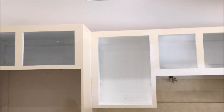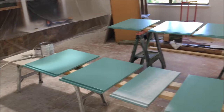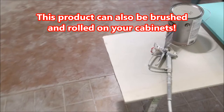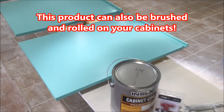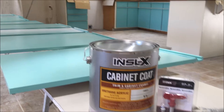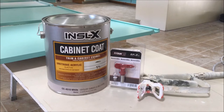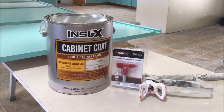I've got the insides primed, and there are all the doors from the uppers. I'm going to spray those with a cabinet paint that's a primer and paint all in one. I'm going to use a 313 spray tip. This sticks to Formica painted surfaces and comes out as a satin finish. I got it tinted at L4 from Richards Paint, which is a nice bright white, and it's going to provide great coverage. I'm going to put the GoPro on and film some of this spraying.